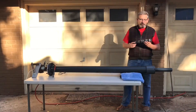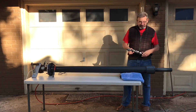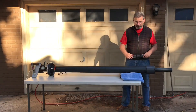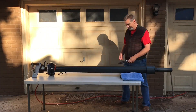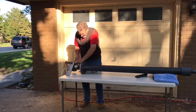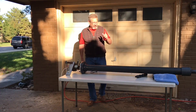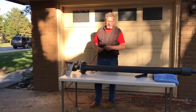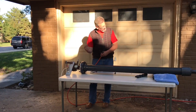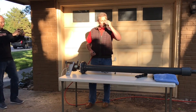So what we're going to do now is put 100 PSI on this and fire it at Peter Pumpkinhead. Let's first charge the weapon. We're at about 95 PSI — my compressor would kick on and get the extra five pounds to fully charge it. We're going to fire this by activating a little air cylinder which will dump a butterfly valve on the back — air goes out this way, and the projectile goes that way. This air cannon scares the crap out of me, so I'm going to put my safety glasses on. And here we go.